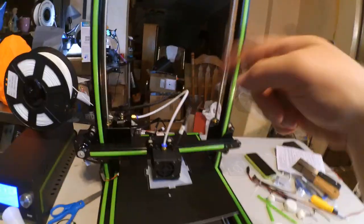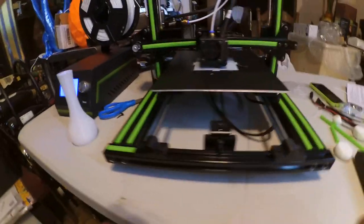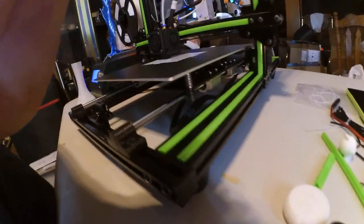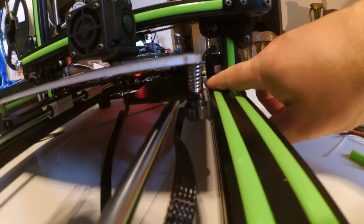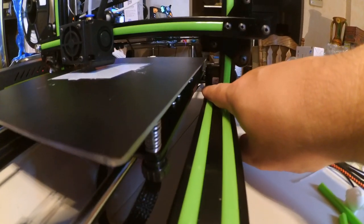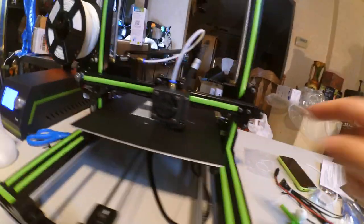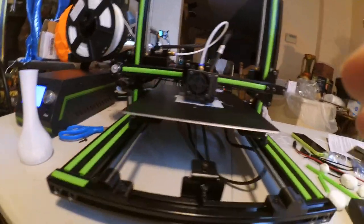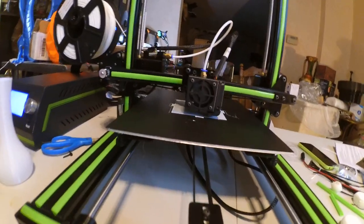I was cleaning up today. See, mostly packaging from stuff that came in while I was at NARAM. Let's see. I don't like this. I do not like how that plug is exposed, so I'm going to rotate the stepper motor so the plug sits on top of the rail back here. It'll still be invisible, but it'll also be protected. It won't be able to get knocked by this if it gets bent or pushed.